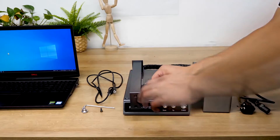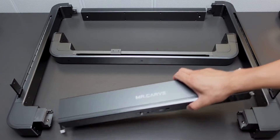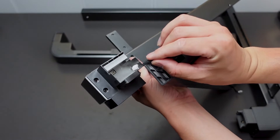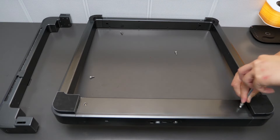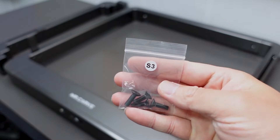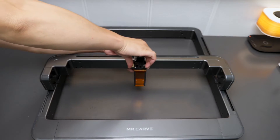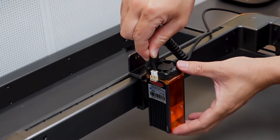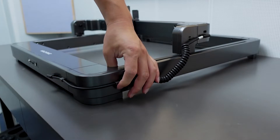About assembly — it's not like its predecessor the M1, which is almost ready to go out of the box. For the M3, you have to spend some time to assemble, but it's not a big hassle. We first connect the cables inside the mainframe and connect the frames, then screw them tight. One thing to mention: make sure to use the right types of screws in different steps — they have marks on each bag so you won't get it wrong. After that, we install the laser head, screw it tightly, then connect the frame and laser head through cables that come in the box, and fix the cables using the buckles to keep your M3 organized.